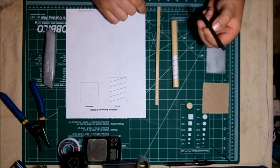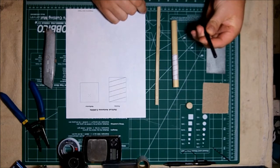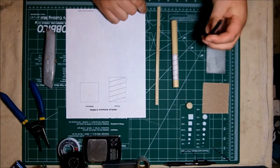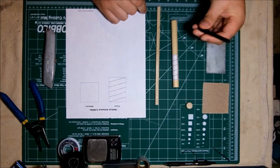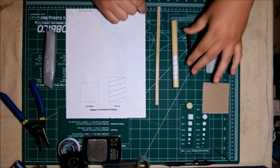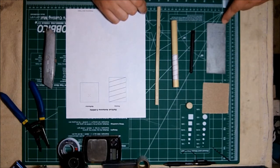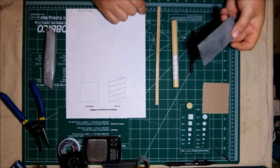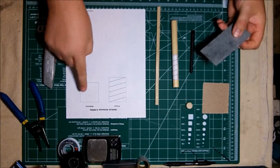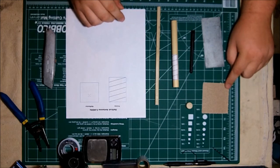We're going to wrap it around that coil. That's just a whip antenna from the 5.8 gigahertz system from Hobby King. We're going to pull it apart and actually use the wire inside for our helicoil build. If you don't have one, you'll have to buy some RG316 wire separately. That's galvanized tin metal. Basically, this is what our reflector would be made out of. We can get 2-3 pieces out of this, so we can build 2 or 3 antennas.